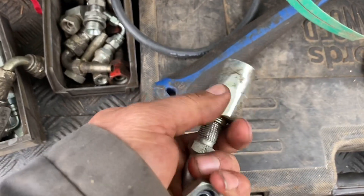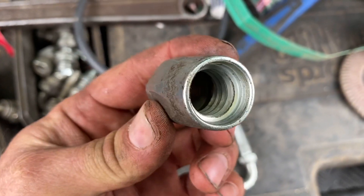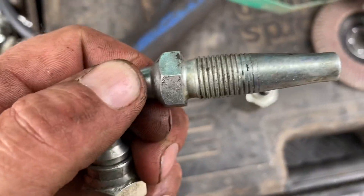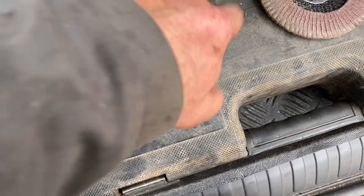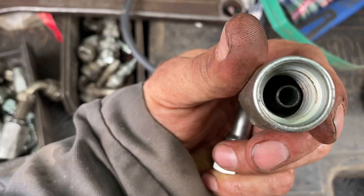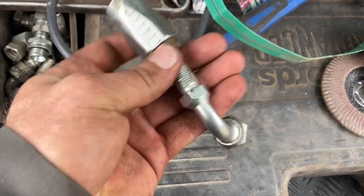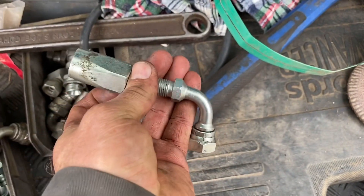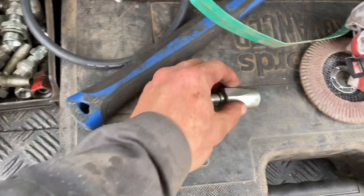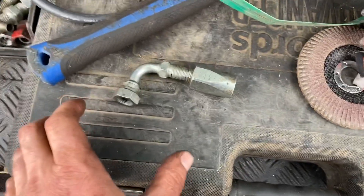They come in two halves. You take this cap off — it's got a left-hand thread — and you screw that onto the end of the pipe. This part is tapered and screws into that. When you tighten the two together it compresses the pipe in and it can't blow off. We get them from Spauldings. They're brilliant in the field because you can use two spanners to change a pipe rather than taking it off to get one swaged on. You just grip it tight, squeeze it — brilliant in the field, and they last forever.